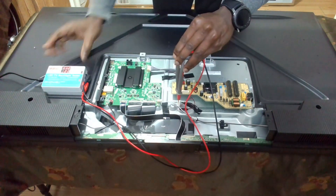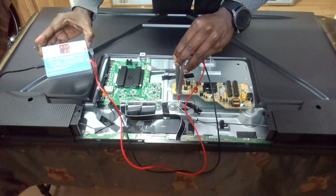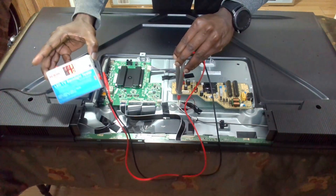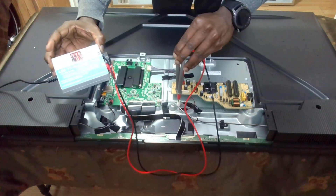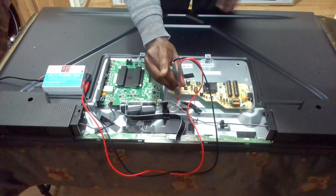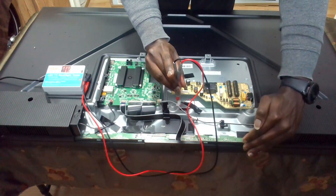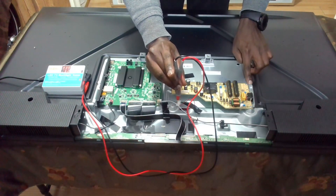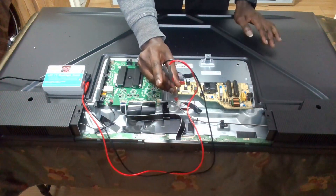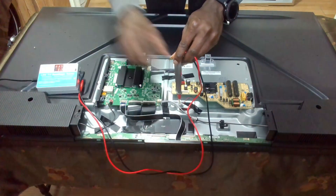I have a reading. It went up to 115 volts with 50 milliamps. So it's an indication that the LEDs are good, and you can see them — they're lit up. I'm looking at the housing here and it's all lit up, as you can see. So I don't think the problem is an LED. At 115 volts it is good.